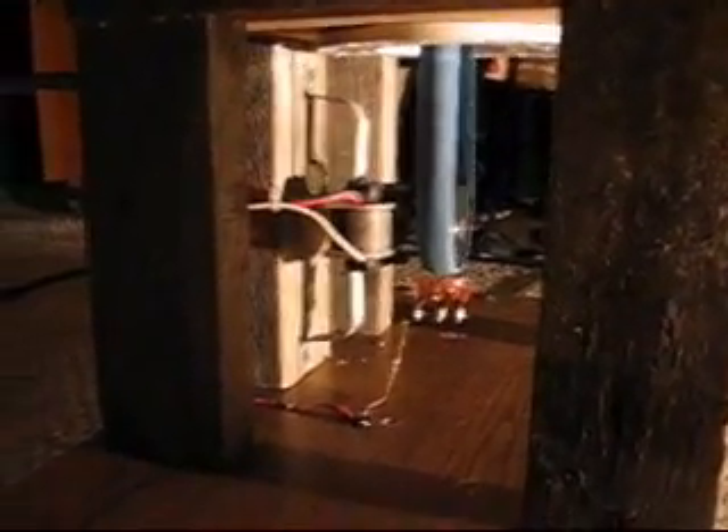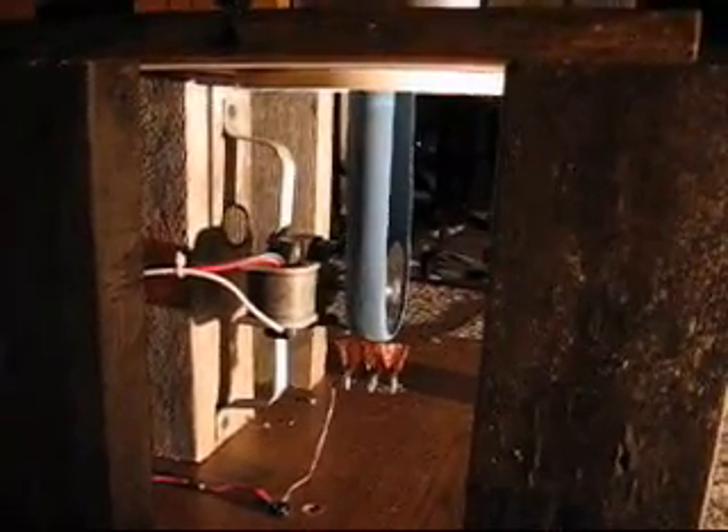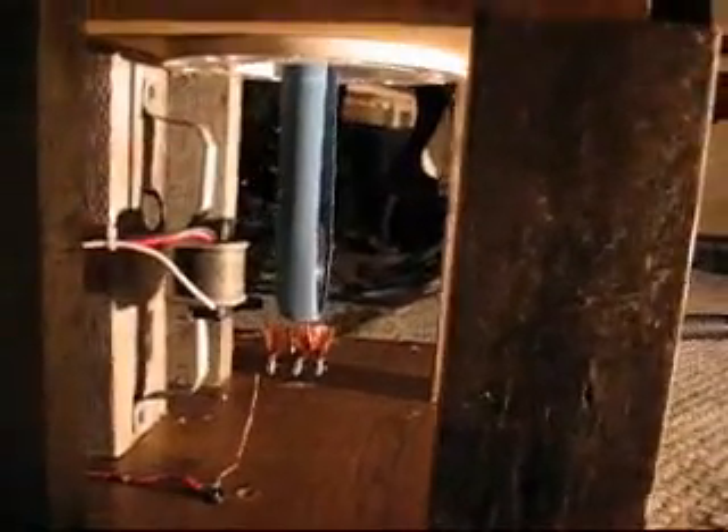Here's the new motor I'm using. It is a standard 120 volt, 60 hertz, 630 milliamp induction motor — no brushes. I ripped it out of one of those overhead hood fans that you find above an old stove unit that sucks the grease out of the kitchen. I scrapped one from a buddy's house who was throwing it away. They can also be found in cheap fans, say at Walgreens for about 10 bucks. It had a long shaft, which came in real handy to attach an ebonite wheel.